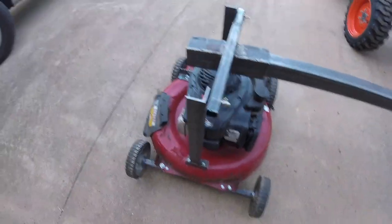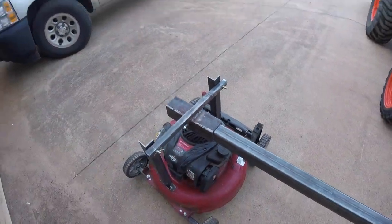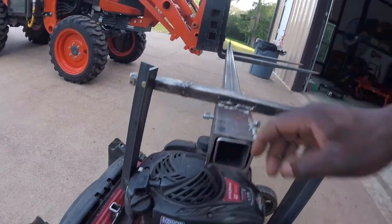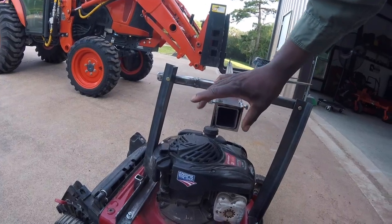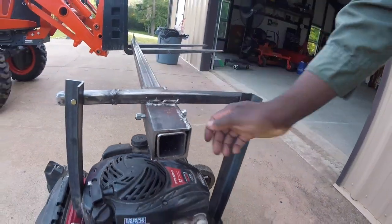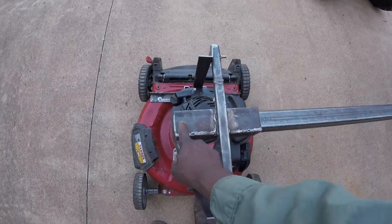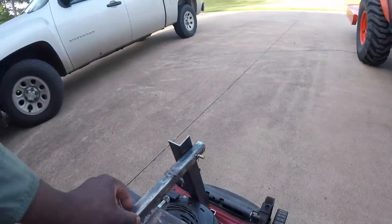That's why you've got two screws keeping this square — it's actually two pieces of angle iron I put together. I already had a hole in this for a hitch pin, but that didn't work out. There's a little gap around here. I didn't want to go buy a trailer coupling, so I just welded these two pieces together, put a hole through it, and this screw has a lock nut on it just to hold it in there. The total length is about nine inches — I measured the hole I had for the hitch pin at four and a half inches, and I wanted a bit more support, so I made it nine inches and welded it on.